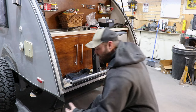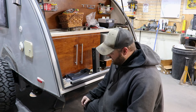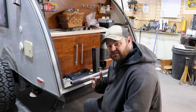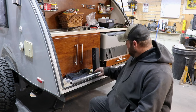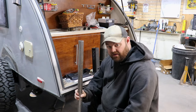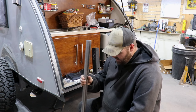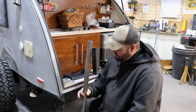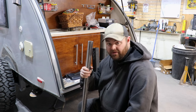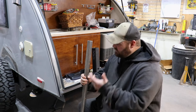I'm going to start in the back of the camper and make my way around each side, because that gives me a nice starting point. The material I'm using is inch and a half by .095 wall tubing, and this is going to be the main rock slider. I may end up using some other materials to brace the rock slider for the fenders and whatnot.